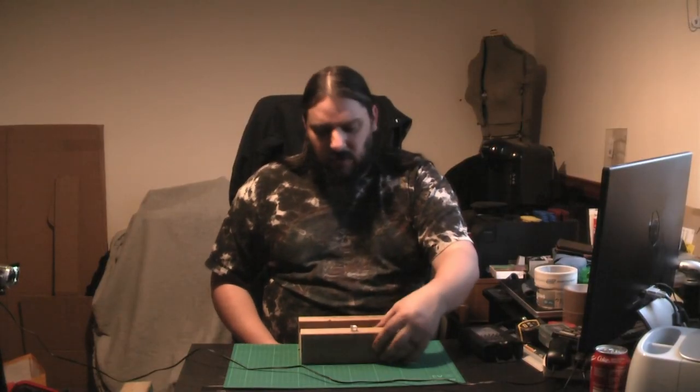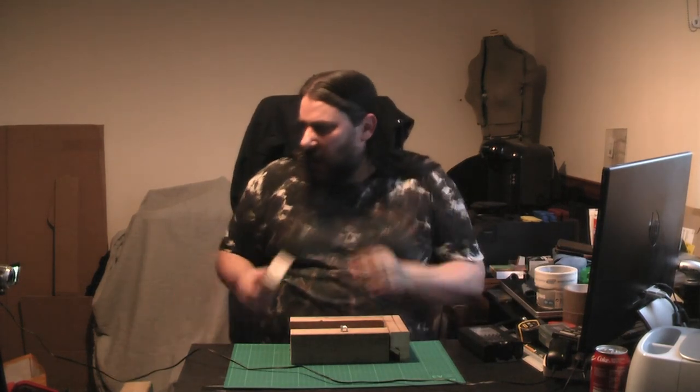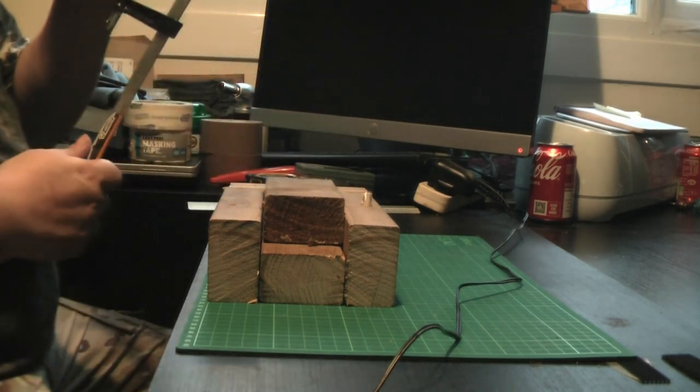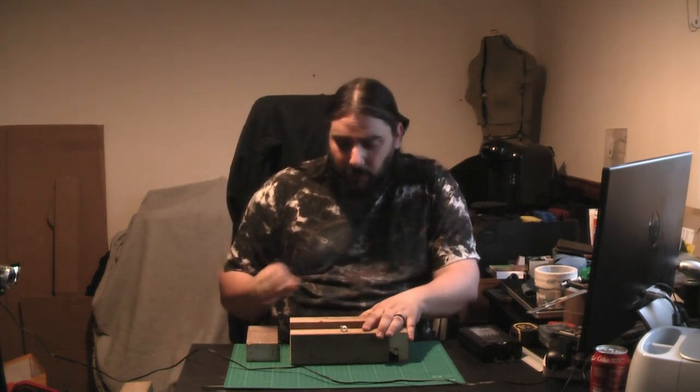So they just get ginormous lumps of wood, lock it together, get way too much resin and fabric, and they kind of squash it all in. And then they get another block of wood, and then they put it on top, and then they get their trusty clamps out, and then they clamp it to death like it owes them money. And then 3 days later, because they use way too much resin, they try and get the mould apart, but they can't because they haven't done a proper mould release. One person I saw did use greaseproof paper, which is something we will come to.